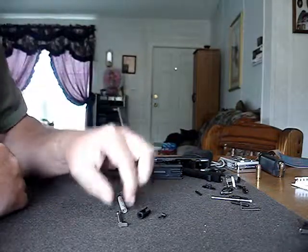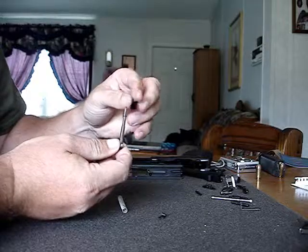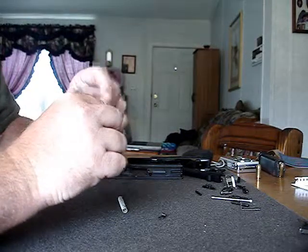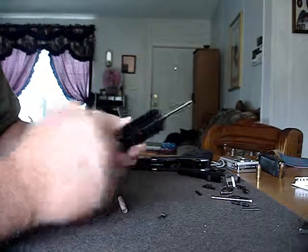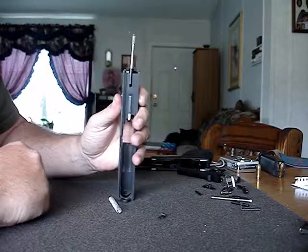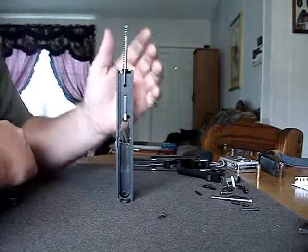Alright, take your firing pin sleeve, slide it down over your firing pin, making sure the foot goes through the groove. Take your slide, your almighty reassemble tool, put the firing pin in there, make sure that the foot is sitting on the metal, and set her up. Your firing pin spring, set it down over the top.